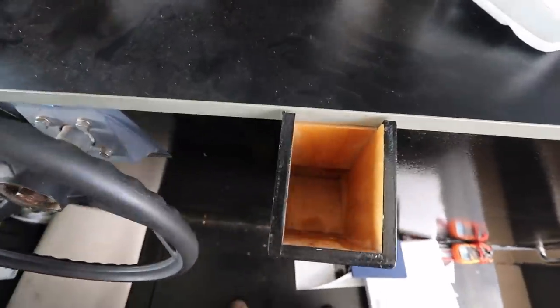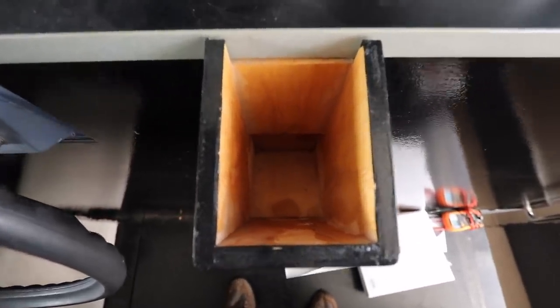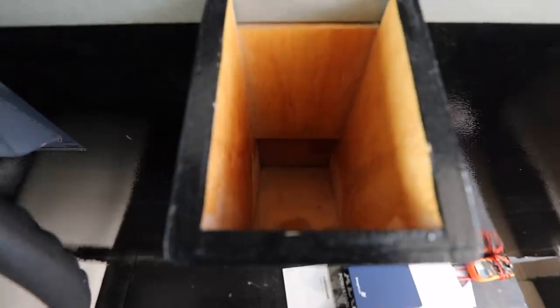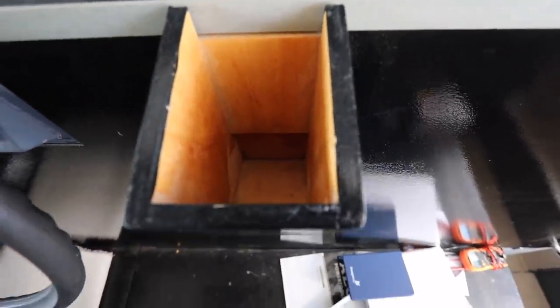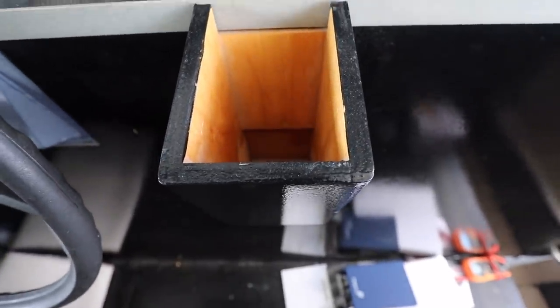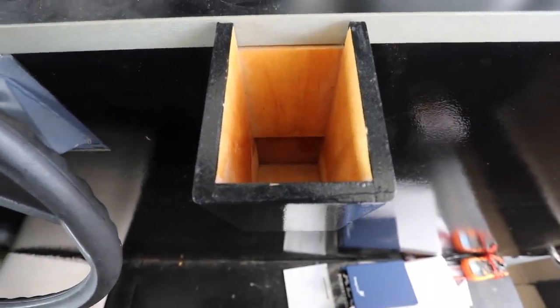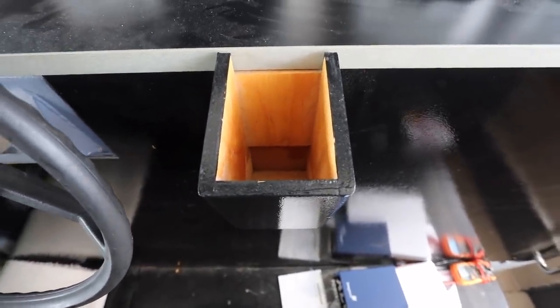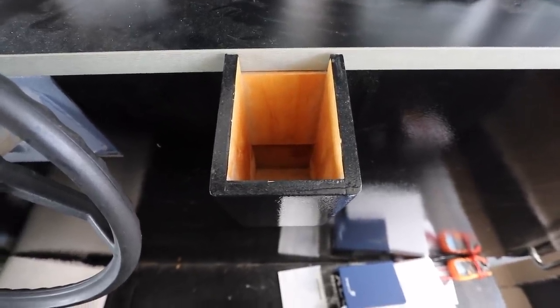So in the wheelhouse, this is the box that our control cables sit in. You can see right down the bottom there, there's a little bit of a hole basically between some plywood, and you can sort of see there's some thinner plywood there we have to drill through. So what I need to do is basically figure out exactly where that piece of plywood gap down the bottom sits on the steel on the other side, because we've got to drill it from the other side. So complex measuring time to make sure I get it right.